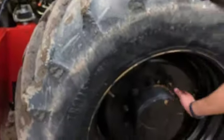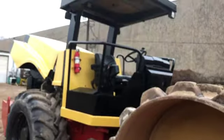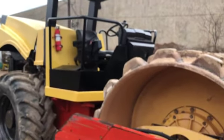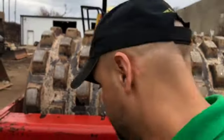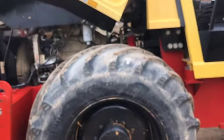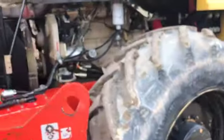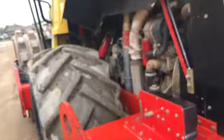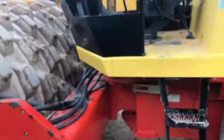This is sand right here, just so you know. All of the fluid levels on this tractor are where they should be. This machine is mechanically sound. There are no leaks on it, everything works. It's pretty much a one-speed hydrostatic transmission. It travels in forward and reverse, no problem. Top speed is 5.6 miles an hour. These tires here are about 85% — they are 23.1-26s. The hydraulics are strong on this machine. This machine is quite possibly one of the hardest compacting vibratory compactors I've ever come across.